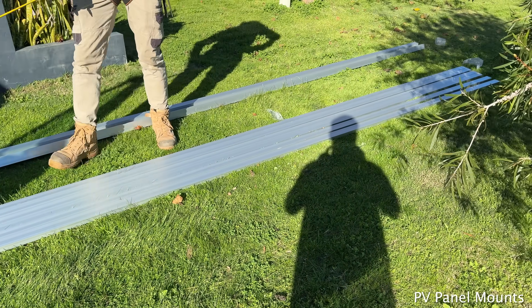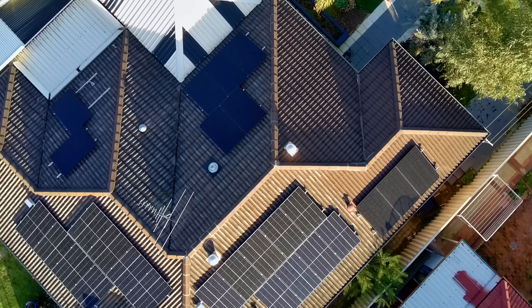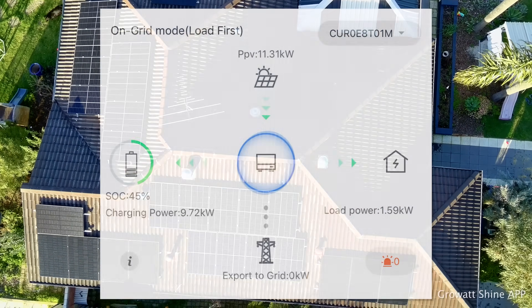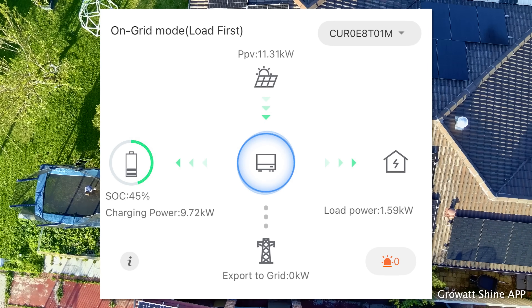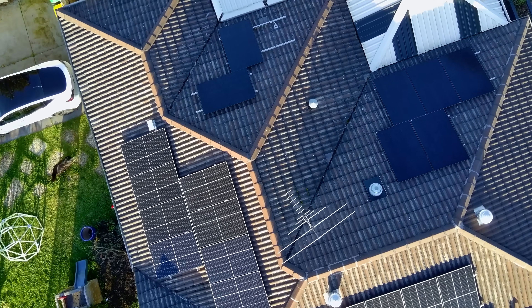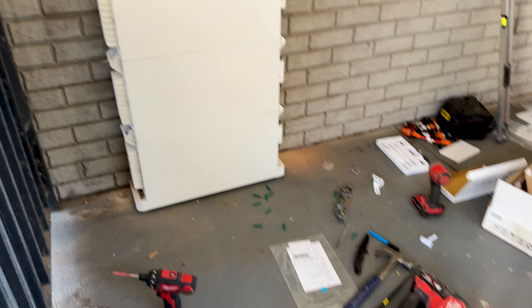I really like the affordability of this system. As Dean from Sentera mentioned in an interview — link below — the Growatt system is on the affordable side but is a premium offering, and that's exactly what I found in my research. The inverter is very powerful and can oversize up to 200% with solar panels. If you're getting 20 kilowatt hours of battery, I recommend adding more panels like I did. During the day I'm generating much more power and utilizing it while charging the battery, so by midday the battery is generally at 100% — and midday is peak sun. If you want to add more kilowatt hours to your system, make sure to do it all at once because you only get one go at the rebate.